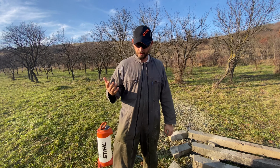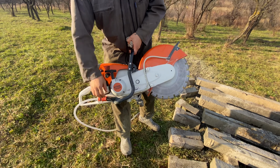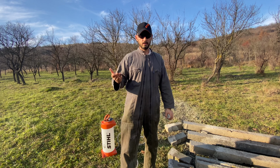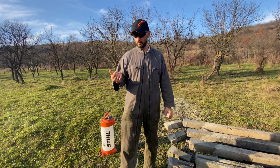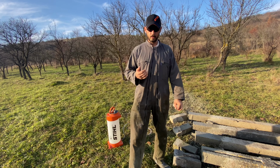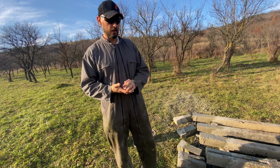This was the video for today with a Stihl TS 800. A real beast. As you could see, with this diamond cutting wheel, we have to use water every time when we cut concrete. If we're not going to use it with water, the diamond wheel will overheat. And also with water, we don't have any dust.